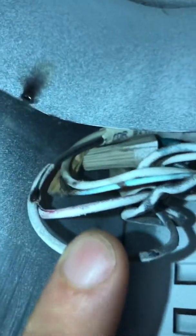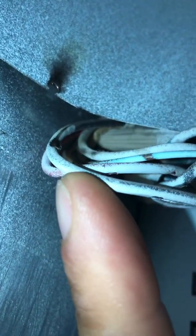As the fan was turned on, the breaker popped. Upon further investigation, as you can see right here, the arcing was right here because this wire was pushed up into the metal. The electrician had not tried to wrap the wires and protect them from the metal, and over time this pushed up and the vibration of the fan caused the insulation to break down and deteriorate, causing the arc and tripping the breaker.